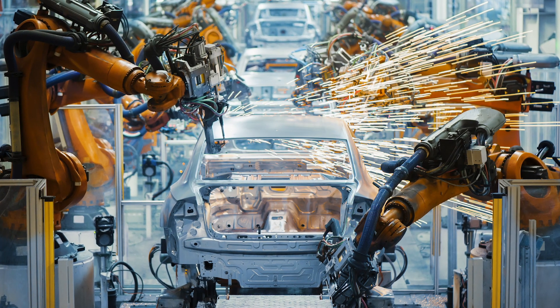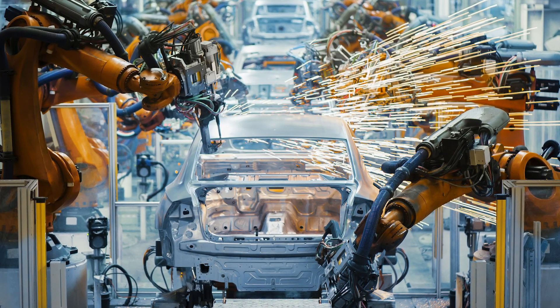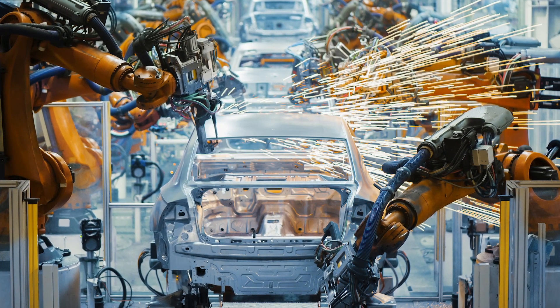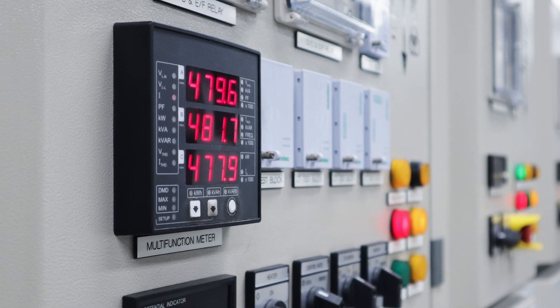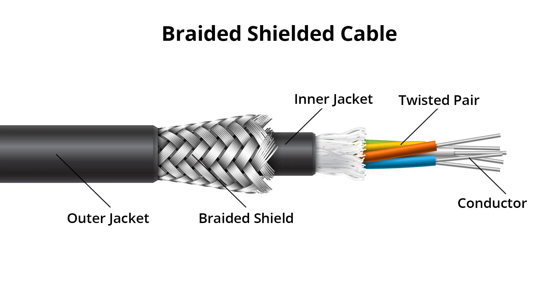A typical manufacturing plant that makes use of a variety of motors, drives, control panels, and power equipment is better served by braided shield. Braids are a woven mesh of copper wires, which is a better conductor than aluminum. There is typically more bulk to a braided shield as well, which can help conduct more noise. But the weave can't provide 100% coverage, so there are gaps in the shield that might not meet the needs of a heavy processing plant.